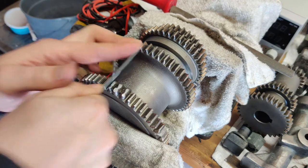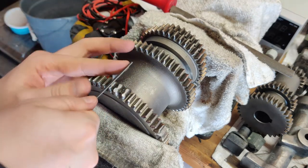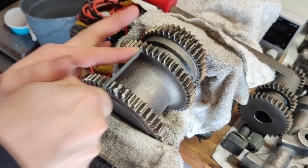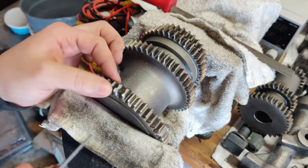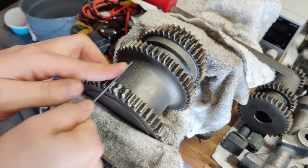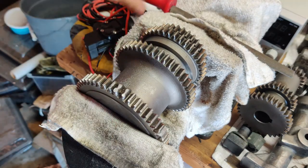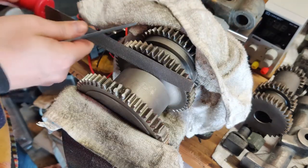That's almost in there. Once this matches up - the front part I didn't modify, and the back two thirds is where I added material - I should be able to file this down to match and have a good tooth. That should prevent any extra stress from having the previous tooth damaged, and I don't want to create more stress on the repaired parts where it might break easier. Though I'm not sure about that - I don't really know my metallurgy too well. These are relatively soft steel, so I don't know if the weld is going to be weaker or stronger compared to that.